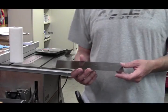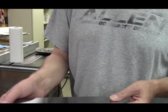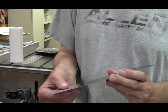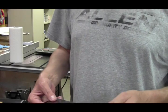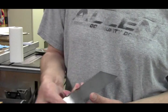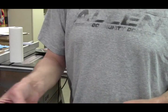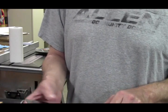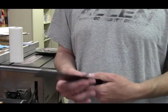I went ahead and sanded this up to 600 grit and it's got a pretty decent polish on it — I think it'll be good enough. I put a little 3-in-1 oil on here and just need to smear it around to make sure I've got a good thin coat all over everything so it doesn't start to rust. I was a little disappointed in the surface finish of the material — there are some small striations on one side that won't quite sand out; it's part of the milling process. It's still nice, but probably won't be noticeable once the saw is together. So with oil on everything, I'll set that aside and go on to the next step.